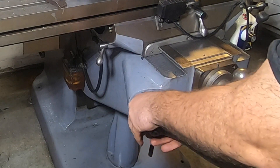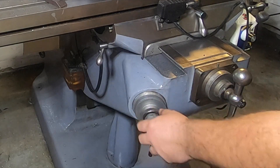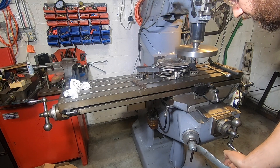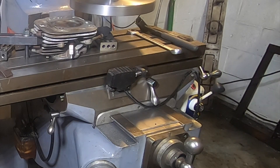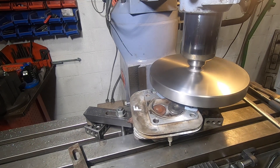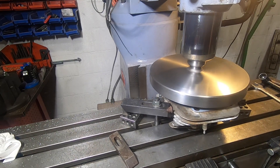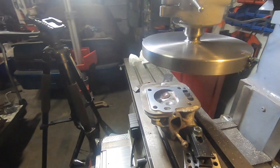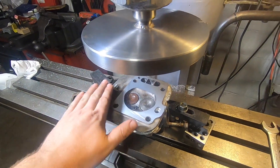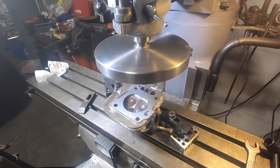There's contact. Zero the dial. Come off the head, drop two thousandths, and let her eat. This head came out great as well. I do have some arcing here that looks like a tool mark, but there's nothing actually there — just when chips get dragged it makes some marks. Back here we have some grease marks in the cut or whatever, but this finish turned out awesome.